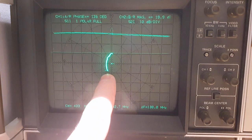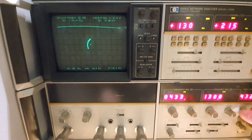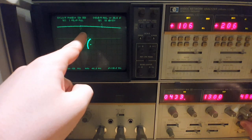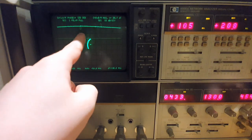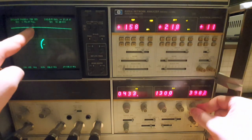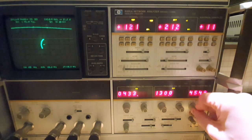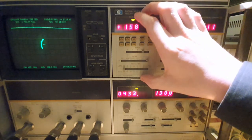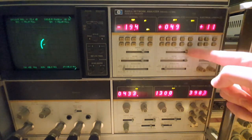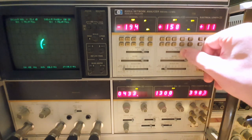This device is amazing — we can use more than one marker. I place marker one at one position and marker two at another, and I can switch which marker is being measured, with the display updating accordingly. We can also use the second channel to measure phase of S11 simultaneously, so we are measuring magnitude and phase of S11 at the same time without losing calibration. We can return to the first calibrated measurement.